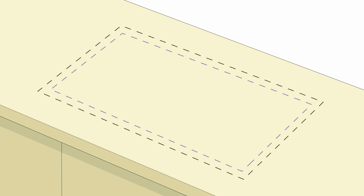Carefully move the worktop to a surface you can drill on. Then, drill guide holes inside the lines you have made in all four corners, and re-drill these holes using a drill with a 12mm bit. Be sure that your holes do not stray outside the inner lines as you drill.